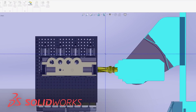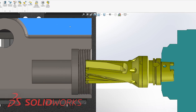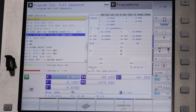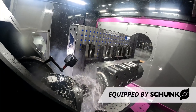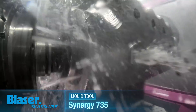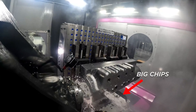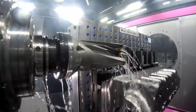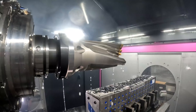Like I was saying earlier, we're not just going to be going to the bottom of the flutes — we're taking this entire tool, holder and everything, down into this counterbore. With tripling our feed rate, coolant is going to play an absolutely crucial role in the success of this process. The added lubricity and chip flushing is going to be the one thing that will make or break this cut. There's no way we would have been able to make it through these holes without our Blaser Synergy 735. If you're running a tool like this yourself, I highly recommend using coolant.